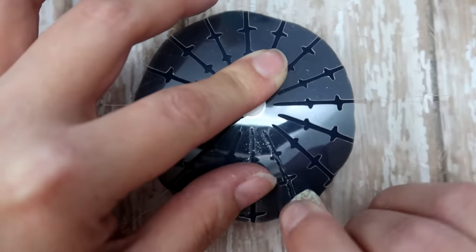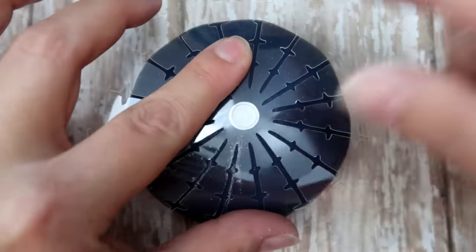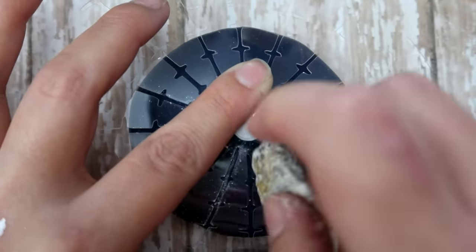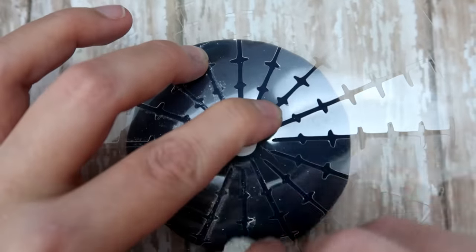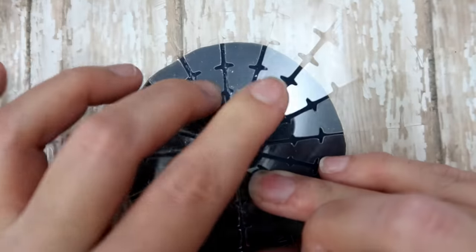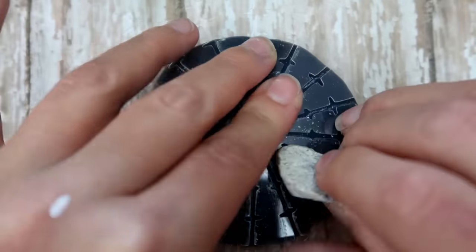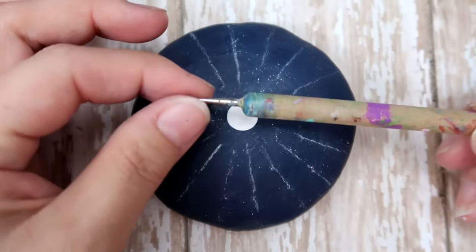I'm using a piece of soapstone because it comes off quite easily versus a charcoal pencil, which I have a hard time removing from my substrate. Chalk works and comes off super easily, but it can leave residue and make it hard to keep paint to stick. Soapstone is a nice alternative — give that a try if you've got some lying around. I'm going to draw all 16 guidelines on there; sometimes you can just use four or eight, but I wanted all of them.